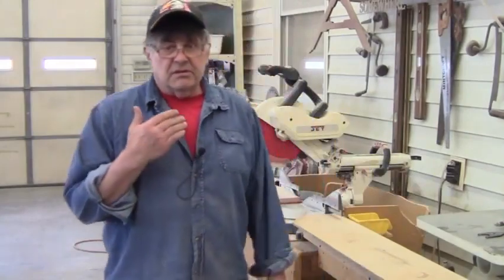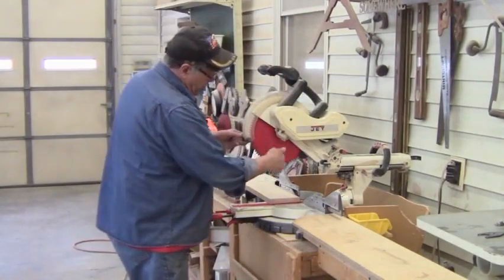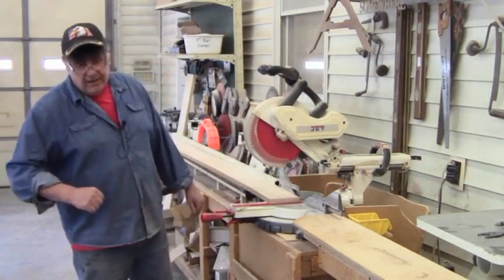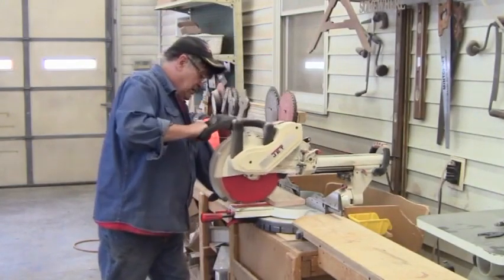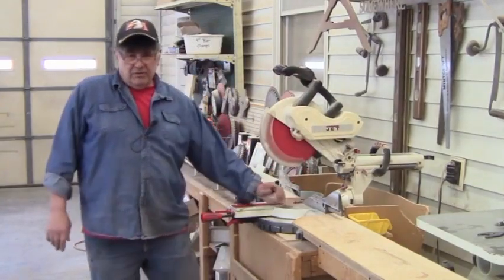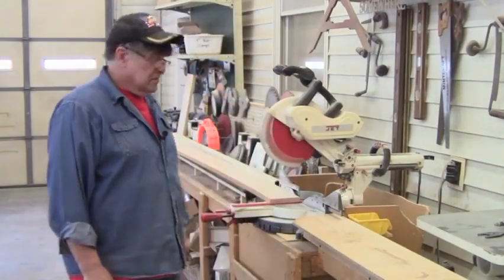For the same reason, on a radial arm saw, the teeth are coming forward, so if you've got a wider piece, it can lunge forward on you. The way to use a compound miter is to bring it out, plunge down, and go backwards.